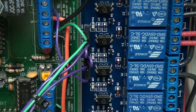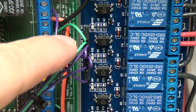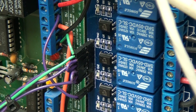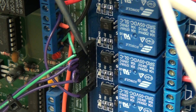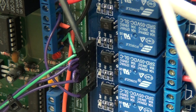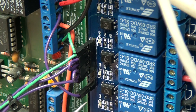You can see these little purple loops — these are the purple lines that run two relays at the same time. From a switch on the door, a purple wire comes over and plugs into relay number one, and there's one right below it which is relay number two. The purple wire loops between relays one and two, so flipping switch four turns on relays one and two. Flipping switch five runs another purple loop to turn on relays four and five. The fifth relay turns on the 48-volt power supply. So three switches run five relays total.